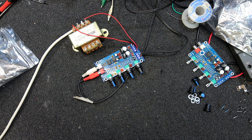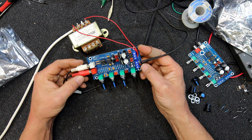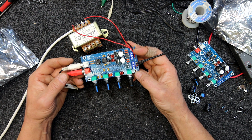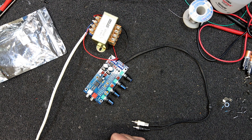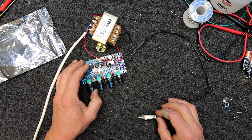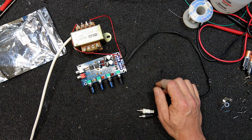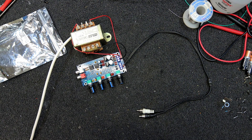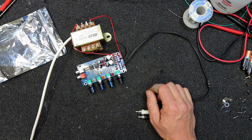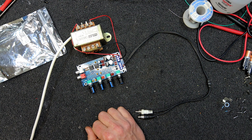These speakers aren't the best to test it on because there's not much in the way of woofers in them, but it sounds like it's working all right. I thought it'd be interesting to try one of these out — I actually ordered two of them. I'm thinking of just building one into a little box so I've got one on the bench I can plug between a CD player or whatever sound source and one of those block amplifiers. I'll find a little metal box and build one in — these transformers are a little bit of overkill but you can't really get much else with up to 30 volts. Since I've got a couple of these Arlec ones lying around I'm not going to spend $30 each on Jaycar toroidals. So thanks for watching.